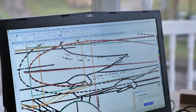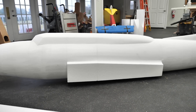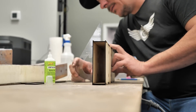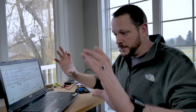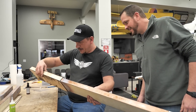We are at the point now where we're going to be joining the fuselage to the main wings. Before we do that, I need to make a template because the wing is not perfectly flat — it's actually angled up just a little bit. It's called positive incidence. We want to match that perfectly, and we need to build a box that the spars are going to plug into. That angle is also going to be really critical. I'm taking the formers on the B-17 that I've already drawn, laying them out on a constant plane, and drawing a basic template to know exactly where to position that wing. From that, we can cut out where our boxes need to go, build the box, insert it, and everything should line up perfectly.